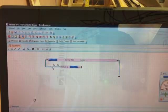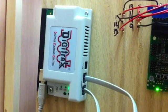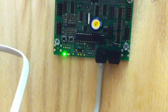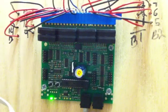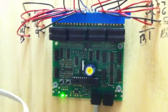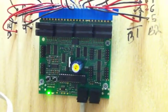Now I'm going to take you down to show you how we wired it all up. Here on our component board: that is the PR3, which is what Digitrax uses to communicate between LocoNet and the computer — pretty straightforward to set up, and their instructions are easy to follow. This is the BDL168 — you can see the green LED flashing and the LocoNet connection right there. To program this board it comes at address 1. Press the switch above the green LED, it will blink a couple of times, then go to your system. I have the DCS50 Zephyr — press Switch, enter the address number you want (we chose 5), and press the C button. TrainController or any other software will need to know that address.